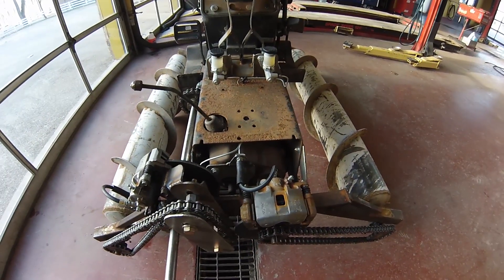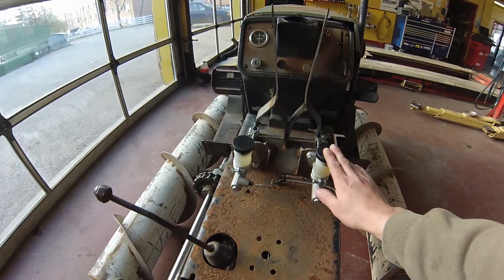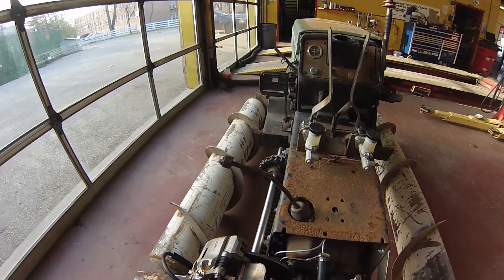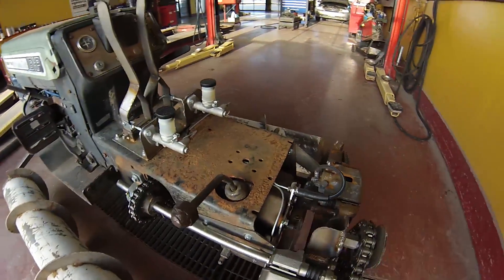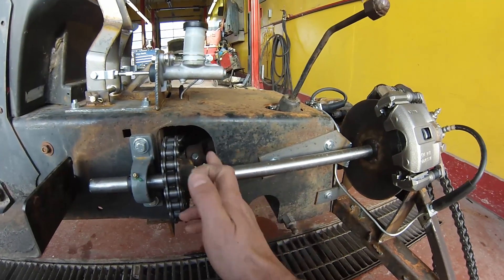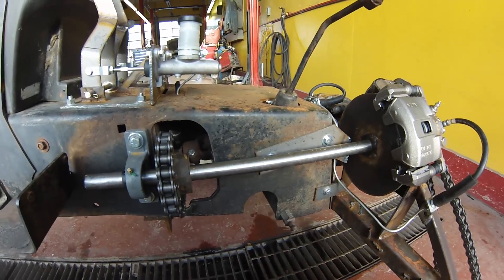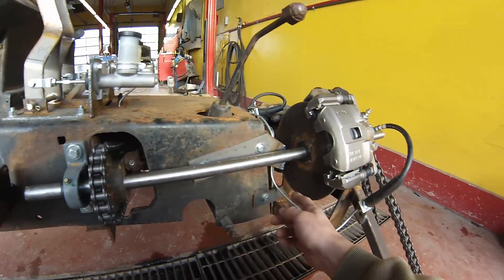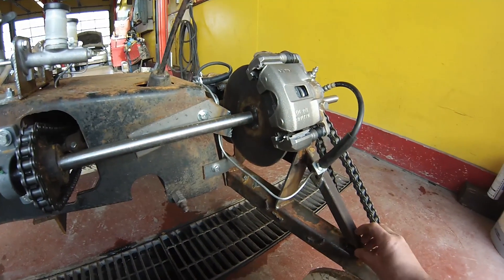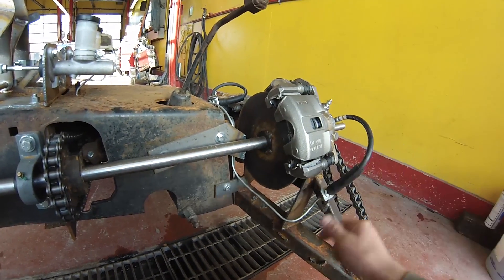Now I've got both the rear calipers on - this is the first one going to the right-hand cylinder and the second one going to the left-hand cylinder. You can see I mounted the second disc on this jack shaft here. I ended up buying a new shaft because the welded one didn't have keyways in it. I was kind of sick of welding the sprockets onto it, so I did it properly now with keyways. I had to get rid of one support for the rear frame, so I'll have to rerun something across there.